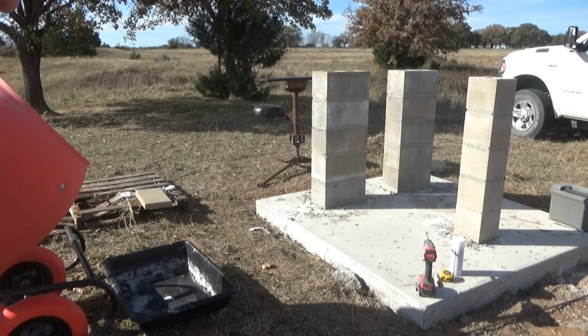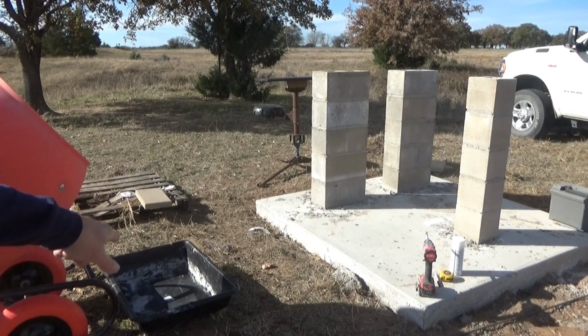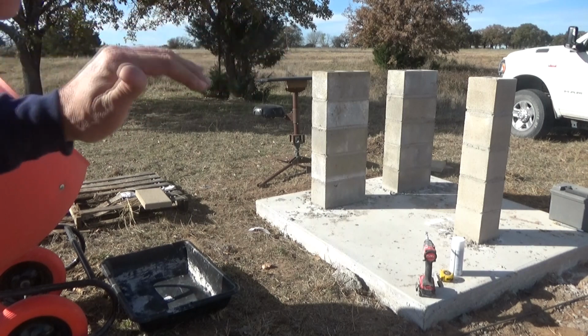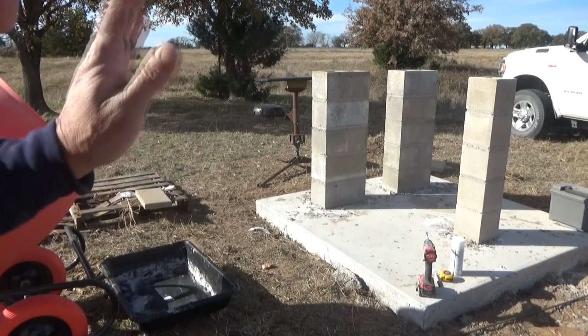So I'm going to dump the water in, get this thing spinning. I'm going to dump bits and pieces into the mortar tub, use the mortar tub as the transfer vessel, carry up and try to dump it in there. When I get near the top, maybe in the last 8 inches, I don't know for sure, we'll see how it plays out, I intend to pour a little bit of a stiffer mix because at the top, I want to have a dome on top of this that the top is going to settle into.